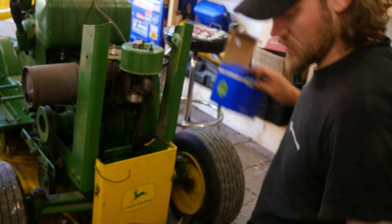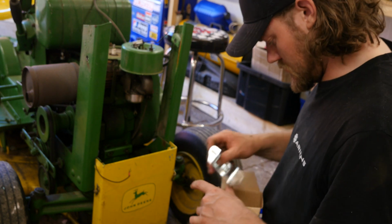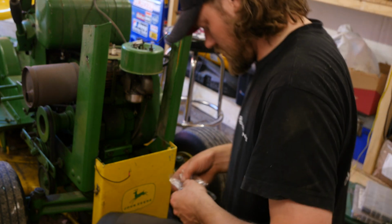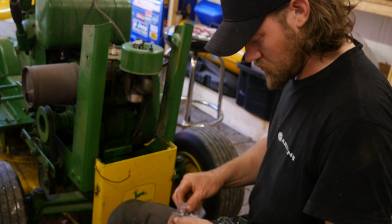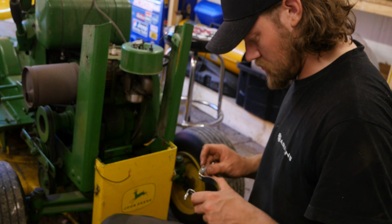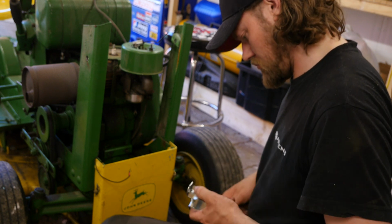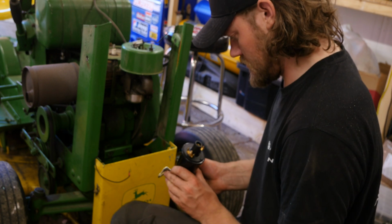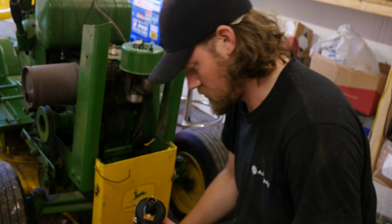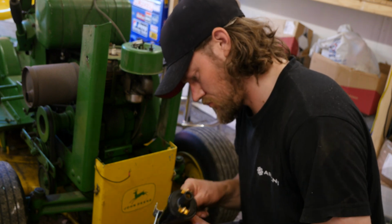It is time for a little service on the old John Deere. I've had some engine problem with this old tractor. Runs fine when cold, but as it heats up, it shuts down on me. And since I am a small engine mechanic by profession, I quickly found the issue to be the ignition coil. But if this is the original coil, it has been there for almost 50 years, so it certainly has done its job. So a brand new one gets installed.